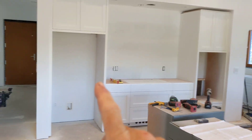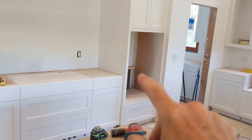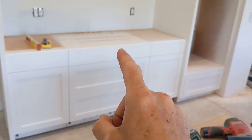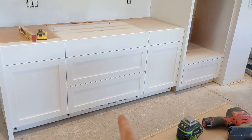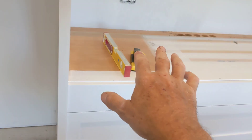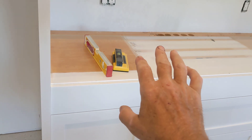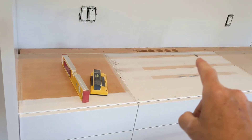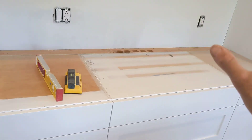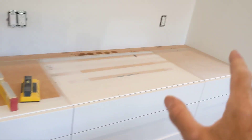We have a refrigerator, cooktop, and oven wall. For the cooktop we have makeup air ventilation along the toe kick and along the back. The countertop is extra depth — 28 inches instead of 24 inches — just to have room for the ventilation in the back, and we have more space on the countertop, which is nice.